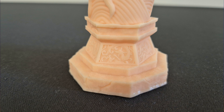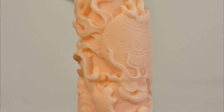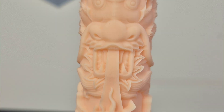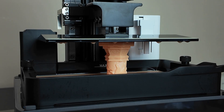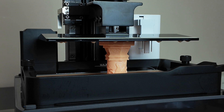This model, at the printer's maximum print height of 25cm, was printed in just 2 hours and 17 minutes. I was skeptical about the print success — the table moves up and down so quickly, meaning the curing time was very short, and I figured I'd definitely encounter a problem. But it didn't work out as I expected. I was impressed with the speed and quality of printing with standard resin from the very first print.